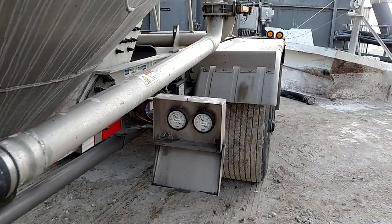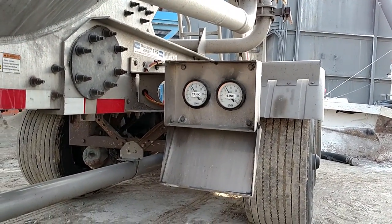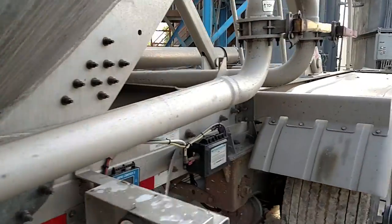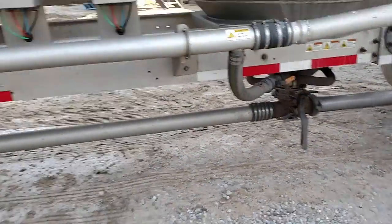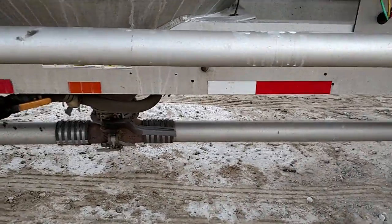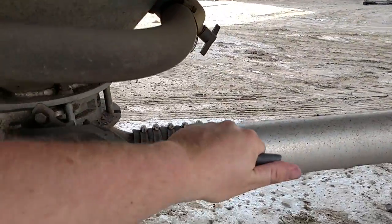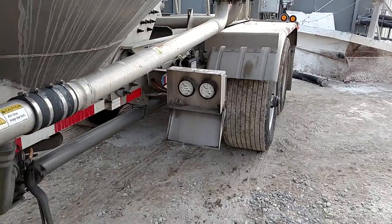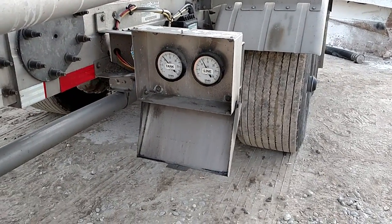This is 10 minutes into unloading. If the pressure is going back down and it's vibrating real hard, the next thing you want to do is go ahead and — before it drops below 10 pounds of pressure — open up your other valve. That way you can maintain your pressure, still use your vibrators, and don't lose any ground.